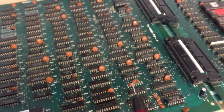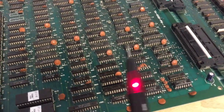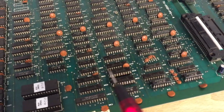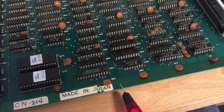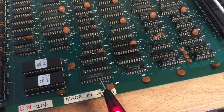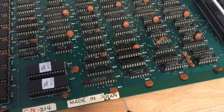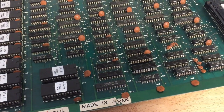could actually do a bit of a cheat, because I do have a second working Double Dragon board at hand. We could take the working lower board from that Double Dragon and replace it with this one, and then check the RAM chip's data lines and see if there's any difference. And maybe we are lucky. Let's see.